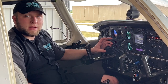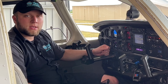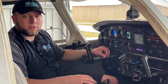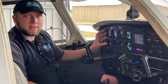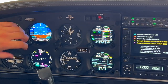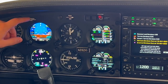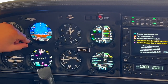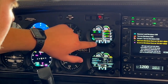Now we're back from our flight. What we're going to do is connect to our 275 and download the EIS data via Bluetooth. One point of note: you don't have to be connected during the flight to have the data download. You only have to connect at some point in time to get it. The 275 will download the data and store it in memory in the meantime.